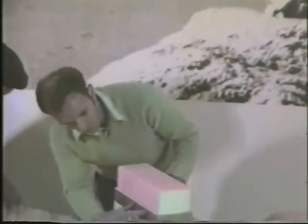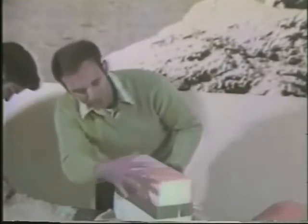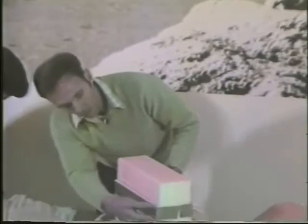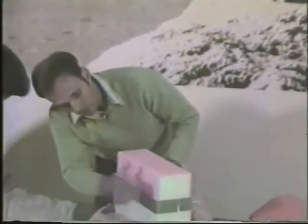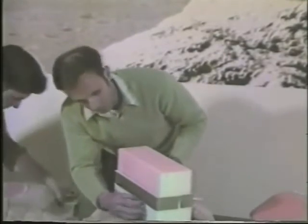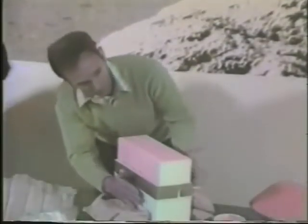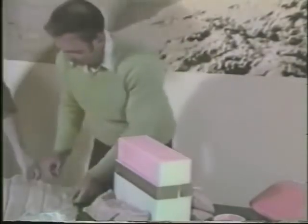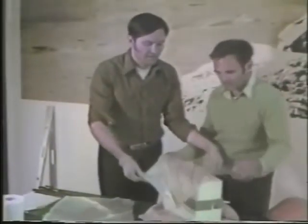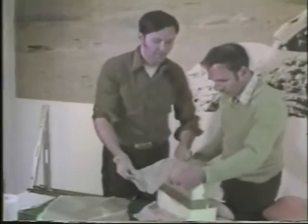We've prepared this piece of foam by slurrying it in the area where we're going to do the shear web layup. We've also protected the rest of the wing with gray tape or duct tape so that when we're doing this layup, we don't spill epoxy onto the foam below, which will be the top and bottom surface of the wing. Just for demonstration purposes so you'll be able to see it, we've shown the fiber orientation of the cloth with ink marks. It's not a good idea to do that because the ink disrupts the performance of the epoxy.